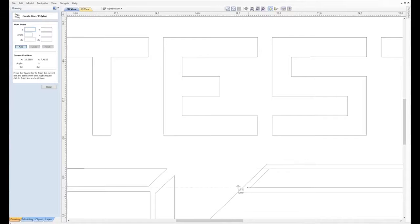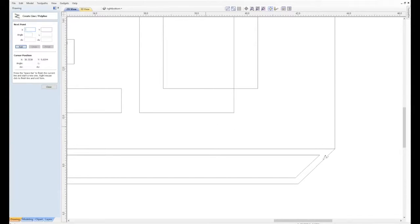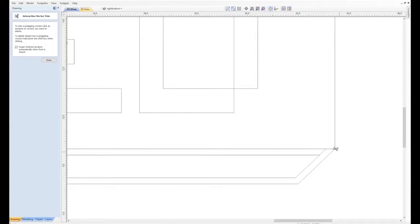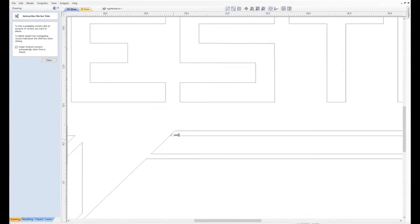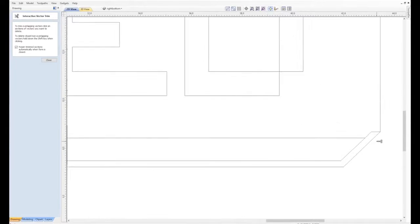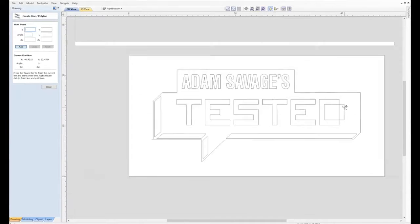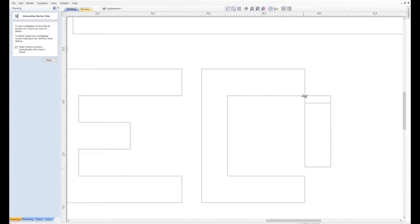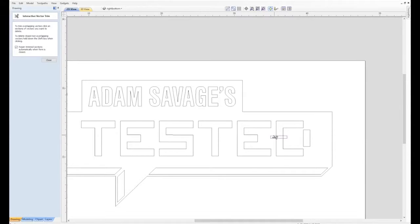So this is a little bit of artistic license — it retains that 3D effect from our logo. You guys chose to drop out the center of the text and have the rest of the sign be steel, keeping it heavy and nicely weighted. That's right — just like a stencil, you can think of any plasma-cut sign as a stencil where you'll need to fill in any sections where the center of letters might fall away. For example, in the 'A' you need to connect it to the outside. You can see we're eliminating the vectors that make up the full 'D' shape just so the center of the 'D' hangs on to the rest of the sign — not just on one side but on both sides, so it's well supported.